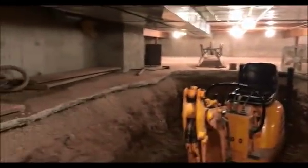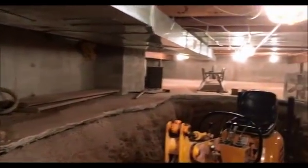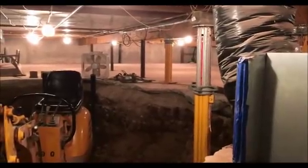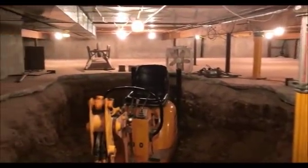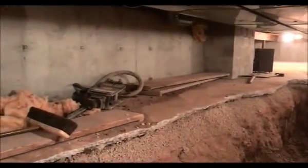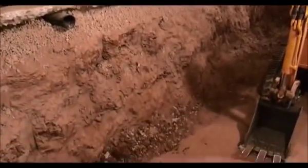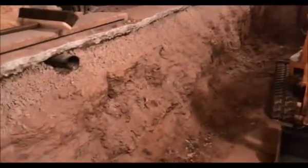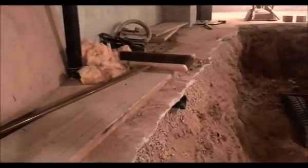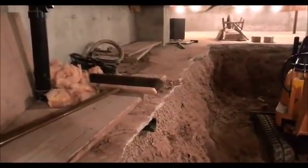It's a good time to explain the underpinning process. You see a concrete wall around the perimeter. A house weighs roughly 300,000 pounds, and two-thirds of that is on the outside walls, which means the weight of the house is about a thousand pounds per foot. The trick is not to cut out the virgin soil underneath it — the weight from that wall goes straight down on original soil. So I take out the whole inside except for a six-foot perimeter.